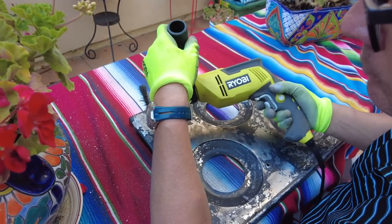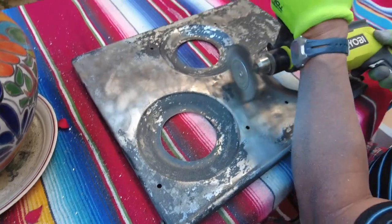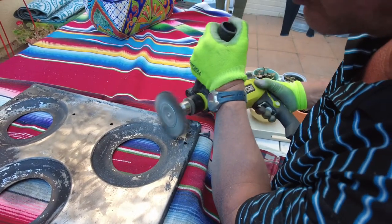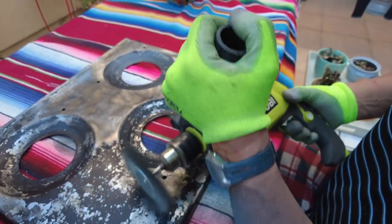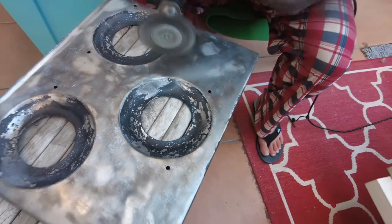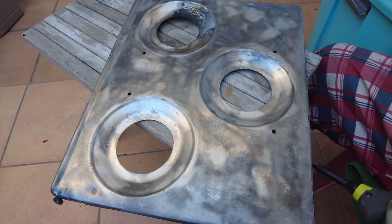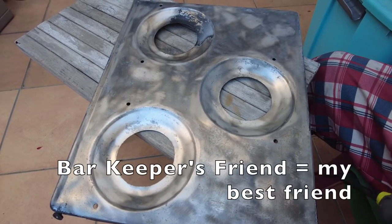David is determined to get a whole lot more off than I could — that is definitely looking a whole lot better. I think he's wearing a whole lot of that paint now. You've got to get all this old paint off because otherwise you put good paint on top of old paint that was already peeling and you get more peeling. So we've got to get rid of the whole thing, and then we're going to get some Bar Keepers Friend, clean it off, polish it up a little bit, and then decide how we want to paint it.